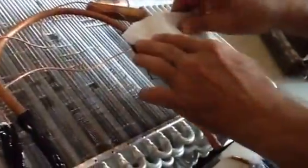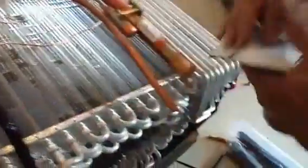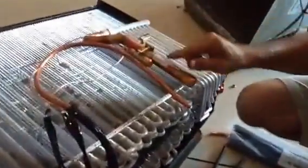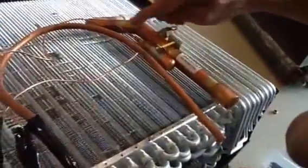I am going to put this up in the attic, because when I get ready to sweat this in, I'm just going to loosen my TXV and slide it out. One correction I want to make — I was wrong: this point here has to face in, always face it towards the coil itself. That was a mistake on my part — we call it a misspeak.